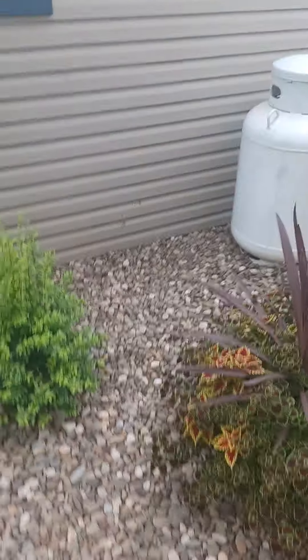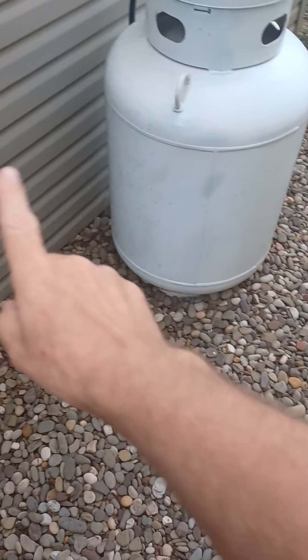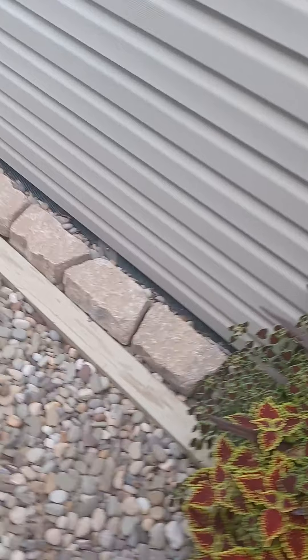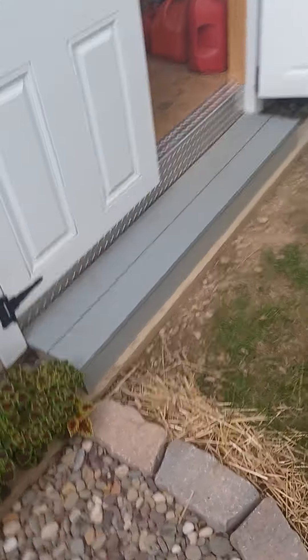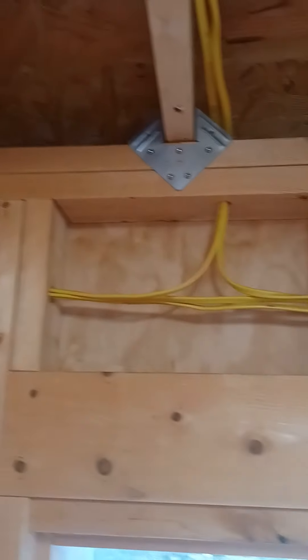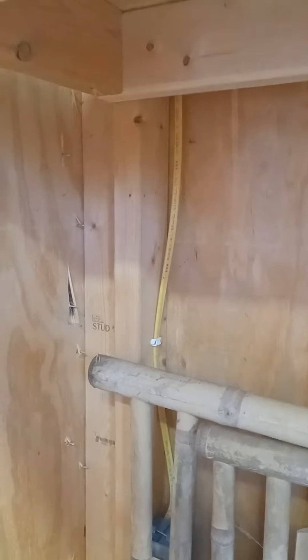Since I have a crawl space, I just dug a ditch out here and tied into a box inside, brought it in on a circuit that had very little on it, and brought it in up underneath so you can't even see it. I didn't put a fuse box or anything in it because it's only got two receptacles and two lights. The light switch — I added a receptacle here and did the wiring. It comes across and up through there, and then down — that's the power coming in. Pretty simple, came out nice.